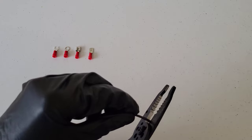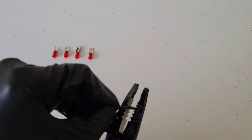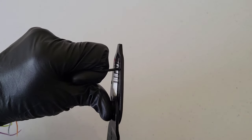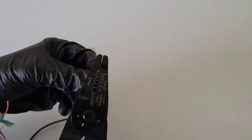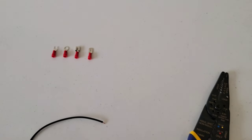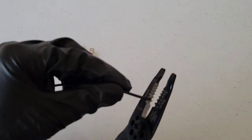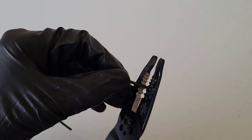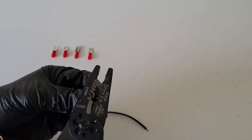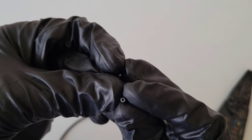What I've found works is moving down to the next biggest gauge. So I'm moving down to the 16-gauge stripping slot and pulling the wire away until it takes the insulation off. I still see one strand, so I'll try moving down to 14-gauge. Let's check — no copper strands in there, so we're good.